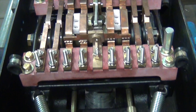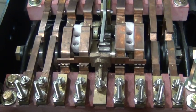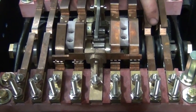This is the contact arrangement on a left hand controller that is operated to the normal position: open, indicating, up against the shunt bar, closed.